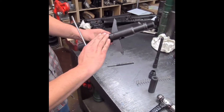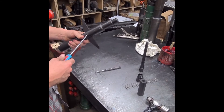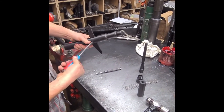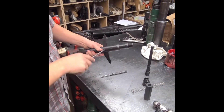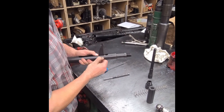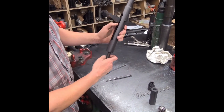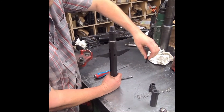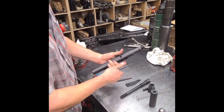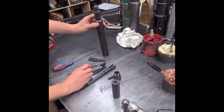This will be bradded, so you have to grind your brad off — or it's just a pain to get these out. Unscrew this little pin. The mandrel pushes up on the spring; this takes tension off the dogs and you're able to get the dogs out, and the other piece out. Disassembly.